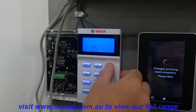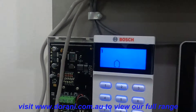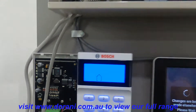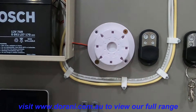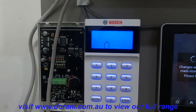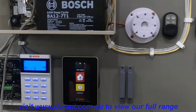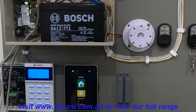For your first fob, press 301 hash. 301 through to 316 are your fob numbers, and the number 1 appears. Then press the hash button — all digits will display — and then press button 1 on the remote. This will then beep at you. Press hash twice and that's programmed. To confirm it's working, press 1 to arm the system and press 1 again to disarm the system.